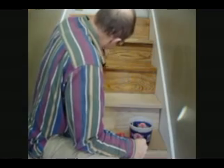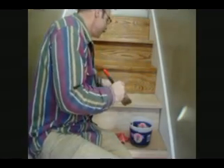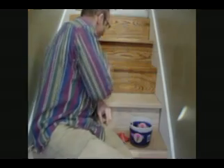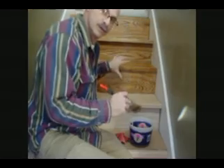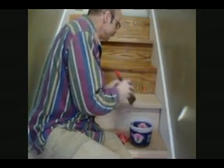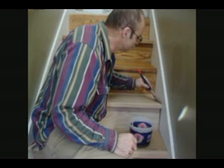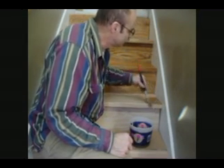If you're running short of time and have to come back, it's best to leave a gap — don't touch the next area whatsoever. If you do, you want to complete the whole step that you're working on before you stop. That way you don't have any overlap marks and it won't look terrible. So stay tuned — we'll be putting the poly on next. I'll see you then.